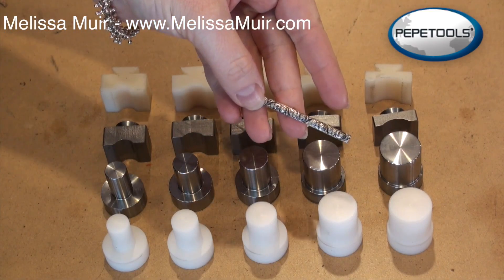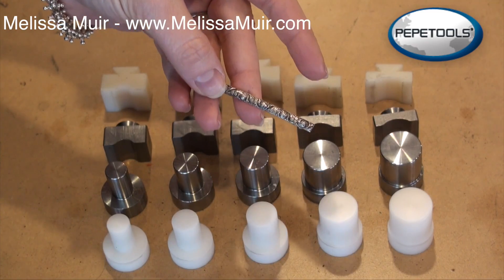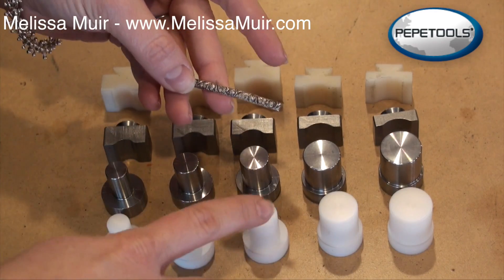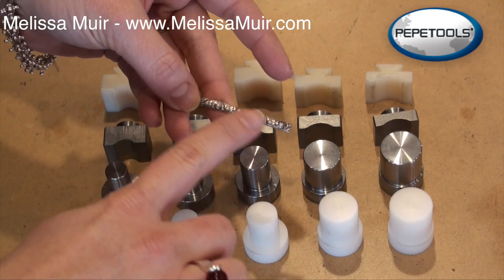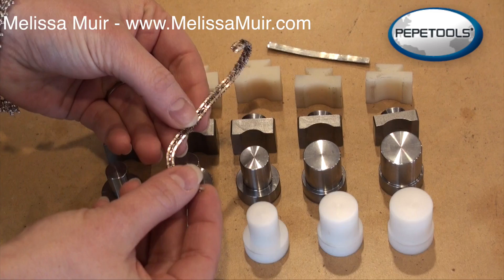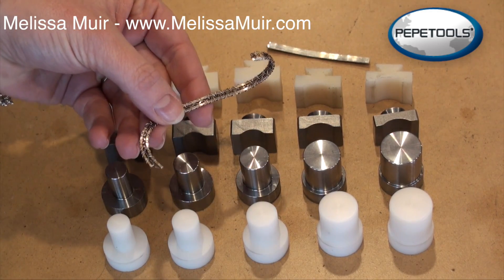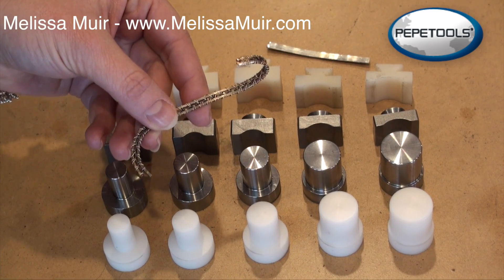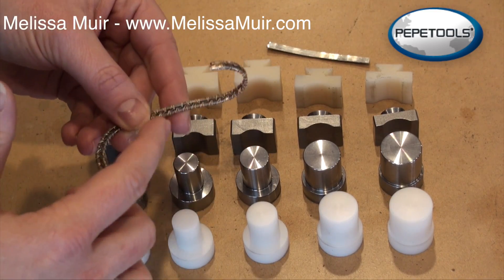For instance, I have a pretty high relief decorative piece of wire here. If I were to take my hammer to this on the mandrel, I'm going to lose all of that detail — it's going to distort, it's going to diminish it. This is a perfect example of when I would want to use some of these nylon mandrels and formers versus one of the steel, because even the steel is going to crush the design on this. Another piece I played around with earlier this week — I just took and wrapped some wires together. There's actually a bundle of three wires in here, all wrapped with 30 gauge sterling silver wire. That's pretty thin and it crushes easily. I actually broke a piece when I just bumped it with my pliers. This is a perfect example of how you would want to use the nylon so that you're not crushing and breaking this fine 30 gauge wire.